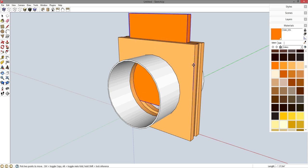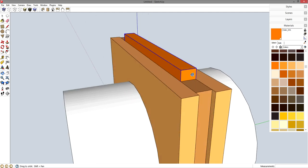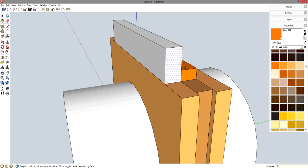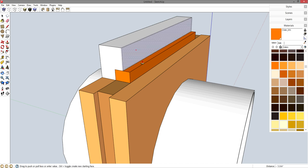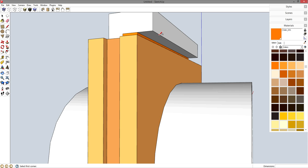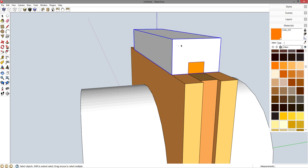The blast gate needs a handle. Let's move this up 1/4 of an inch and draw a handle. R for rectangle, from here to here, P for push-pull — this is 3/8 of an inch — and let's go up 0.5 inches. So 0.5 plus 1/4 is 3/4 of an inch material. R for rectangle from this corner back here up to here, P for push-pull, let's pull this out to this face. R for rectangle from here, drawing on the bottom, down to here. P for push-pull, let's pull this down, spacebar, triple click, G for component, enter. This is a piece of 3/4 inch stock with a little dado in it to accept the center gate.